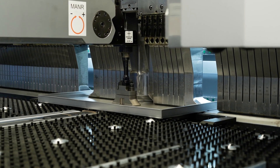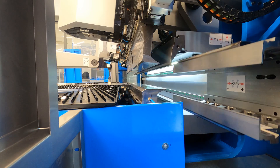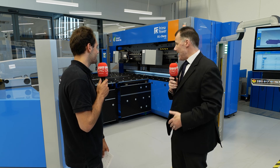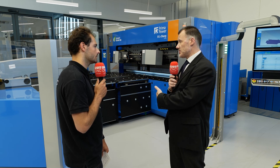What about safety, Barry? If there are 28 axes moving around in that machine, you need to make sure they're not going to be touching any of your operators. Most of the axis motion is going on inside the machine, but this particular model has got light barriers, as you can see behind us. You're able to go into the machine and change the part — give it a blank, take away the finished piece. As you come in and out of that system, you're activating and deactivating the safety system. The machine knows the operator isn't in there and is good to go and start again with the next part. It's intelligent — calling programs down as it works, so if we're working on a kit rather than a series of productions, it knows to make the next part in that kit rather than the next part in the batch.